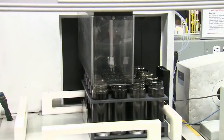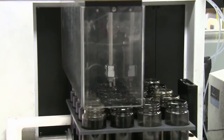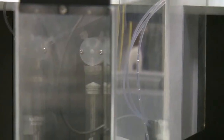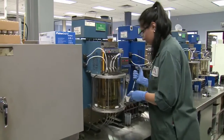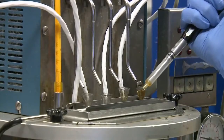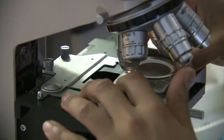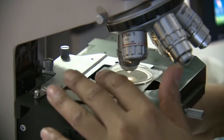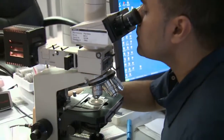Next is an infrared spectrometer. This will check for the age of the oil and contamination that could suggest combustion issues, again from near-instant analysis. The most important property of oil is its viscosity, so that too is tested to see if it's within specifications — not too thin or thick for what it's designed for. But it's not all flashy machines and cutting-edge robotic technology; good old-fashioned microscopes are used for visual examinations that cross-check for particles found in the sample.